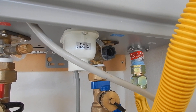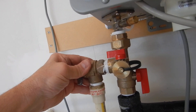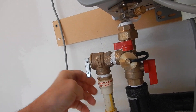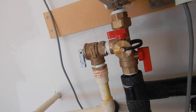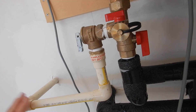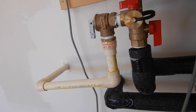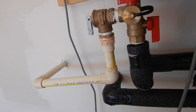This is more important than on a conventional water heater because it's so cantankerous — such an exotic sports car, if you will. While I'm down here: this is not your temperature pressure relief valve, this is your pressure relief valve. Since it's just pressure, it does not have to be insulated. We have almost the right type of piping, but the code says you're supposed to have a vacuum breaker in the same room as the water heater. This pipe should have a vacuum breaker on it — we don't have one — and it terminates too high.